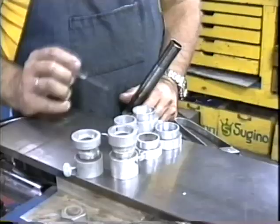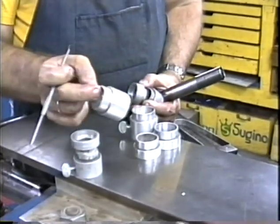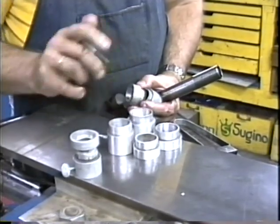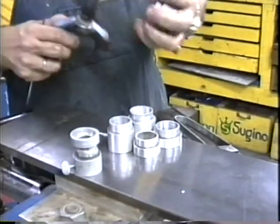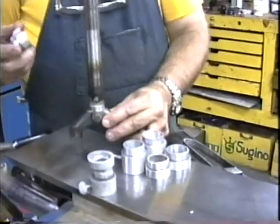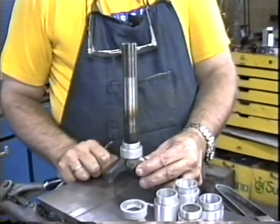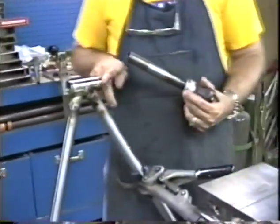I'm building this bike tall stack. And incidentally, these 2 headsets back here, this one's for 1 1/8" steering columns, this is for 1 1/4" steering columns. Both of these would be used in lugless construction. Alright, what we're going to do is we're going to take our fork crown that's been all cut to size, and we'll drop the bottom half of that dummy headset over it, and then we'll go over here and we'll stick it in the frame.